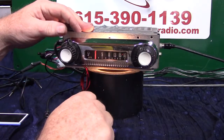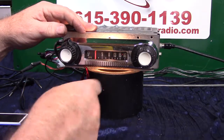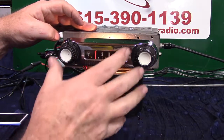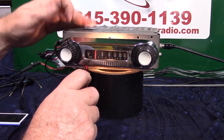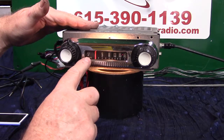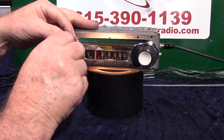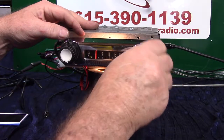I'm going to show you how to put it in the scan mode — that's the reason the LED is in there. You've got these wires coming out; this is built into the head. You plug them in after you get the radio back together. When you get the radio, the needle will be set on five and the tuner will be tuned to that five, so make sure this is on five before you slide it together. To get into scan mode, you take the tuner knob and turn it up twice — one, two.